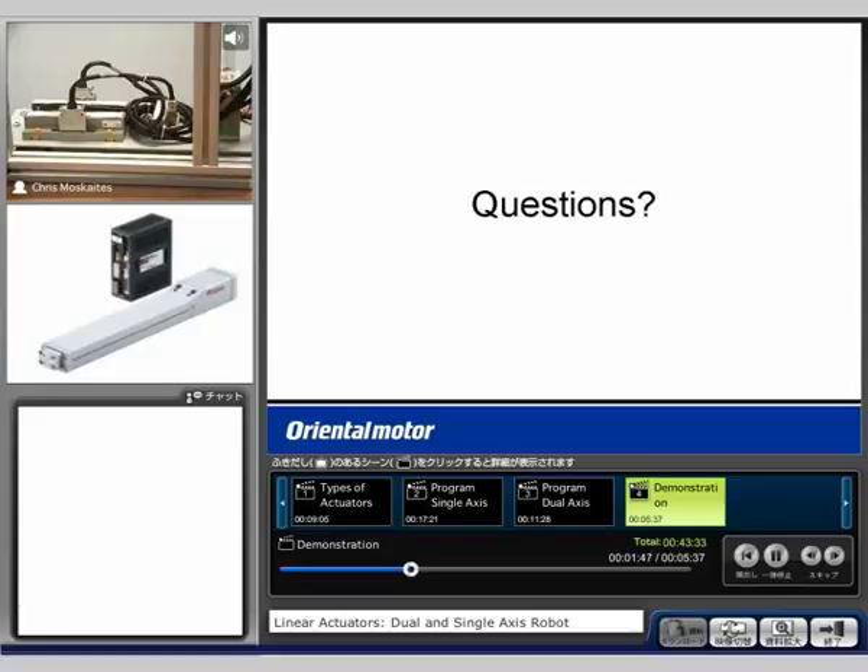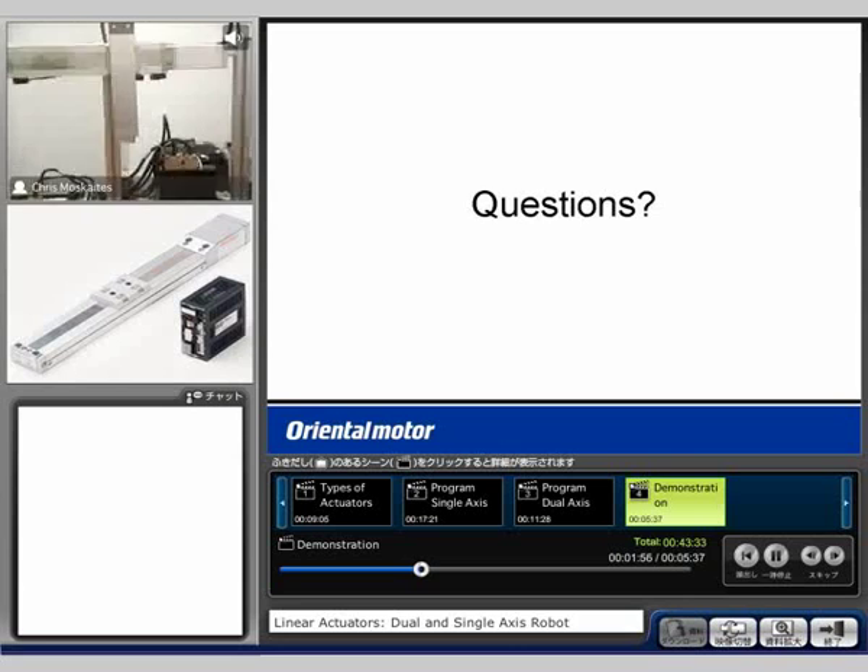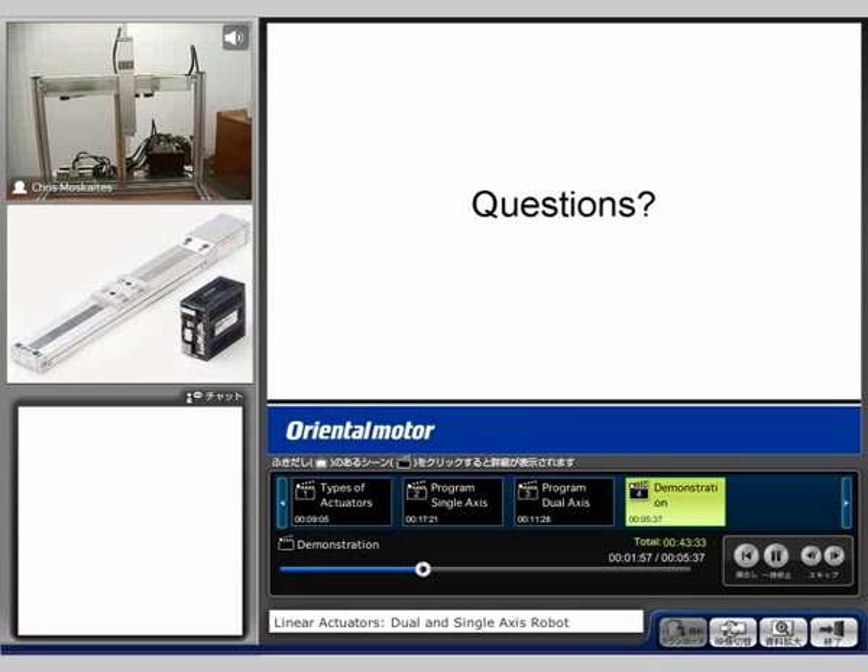Just for a quicker setup. We'll also see that we have a 24 volt power supply built in here for the IO. The drive also — we communicate based on this cable here. This allows me to connect to my computer to program. There's a phone jack type connector on this end, and on the other end I'm going to connect to a serial port.